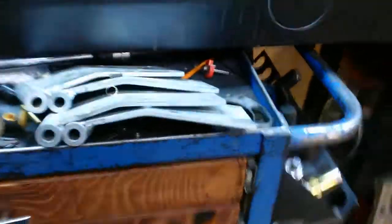Right now it's got a bunch of junk on top of it. The drawers we have finger jointed up and the bottoms I have doweled in. So every three inches or so I've got a dowel driven in to the bottom there.